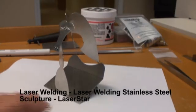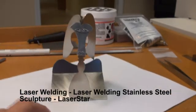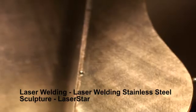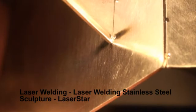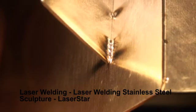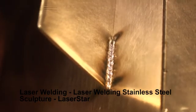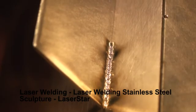Here's the part all tacked together — it's only tacked right now. We're going to go inside and weld all those pieces together so it's nice and sturdy. I put a few more tacks on the sculpture to keep it in place and we're going to start core welding now. What I'm doing here is running a welding bead where I want this to be permanent, and I'm going to do this in all the areas where the sculpture is touching.